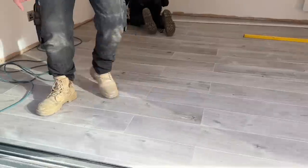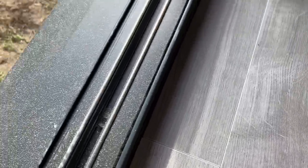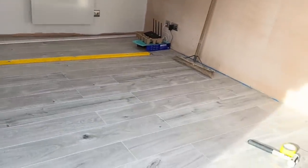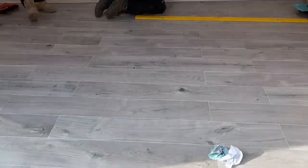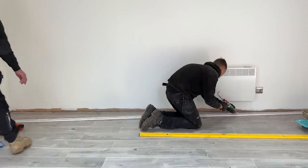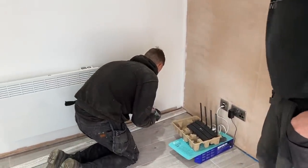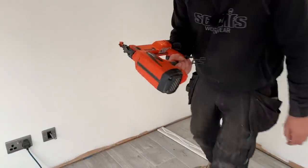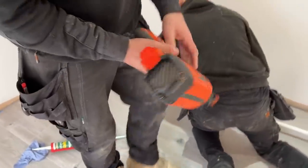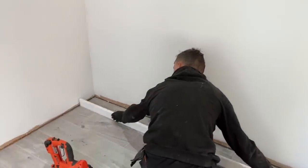The laminate floor is down. I didn't bother measuring from the back — I never do — but that's how the end pieces fit. We've got a 10mm expansion gap there. We are going to put some quadrant over that. The customer came out and asked me to change the pattern, so we ended up buying another pack. David's fitting the skirting board now — it's primed MDF. He's using liquid No Nails and will fix it with a Paslode F18 nailer with stainless steel brads.